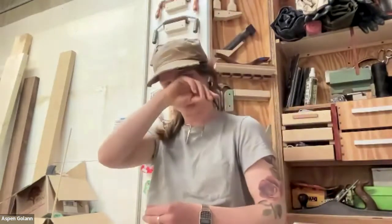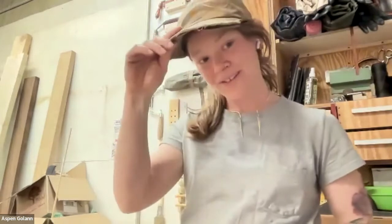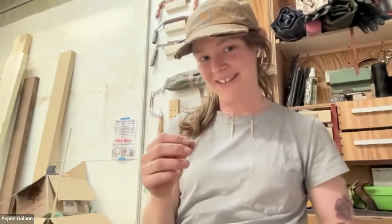I just made up that process of getting that Hitchcock imagery without having to build a stencil. How did you do that? What is it painted on? In the Fine Woodworking webinar, I even went over how I made the gold. It's basically a gold powder mixed with oil. I covered the piece with thin, delicate painter's tape, drew imagery directly onto the tape, used an X-Acto knife to cut all of it out, but did not peel anything off. Then I would peel off sections at a time and airbrush around.